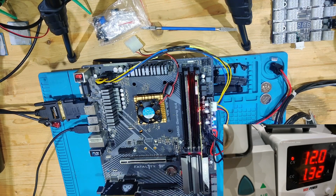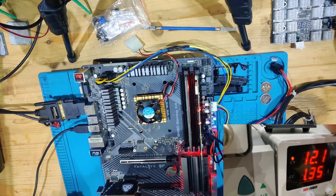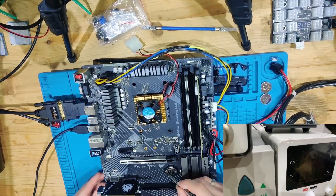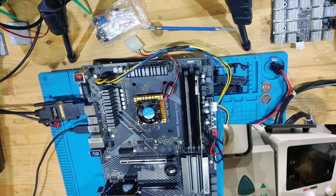It started by itself — let's turn it off via the power supply. Let's remove the BIOS battery now. Is there any header called Clear CMOS or something? Yes, there is. I'm going to probe this header using tweezers just to hold it on those two pins and we're going to wait a few seconds. We're also going to press the power button a few times.